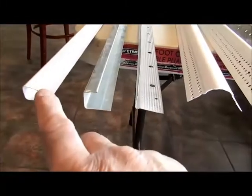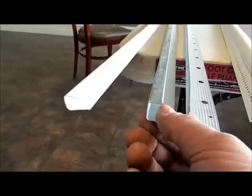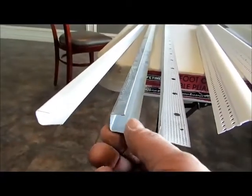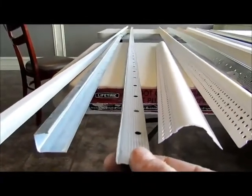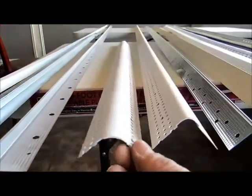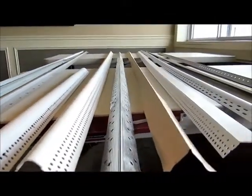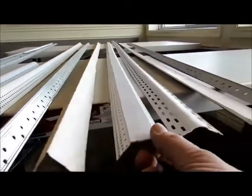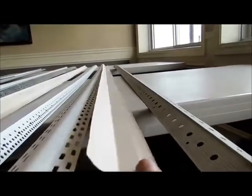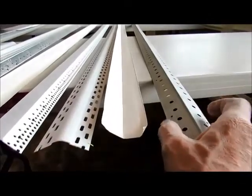A lot of choices here. J-trim — the plastic PVC can be stapled, nailed, or glued. Aluminum and galvanized can usually be nailed or glued with construction adhesive. The metal ones with the holes usually use ring nails. The PVC we apply with spray-on adhesive and staples — usually staples and spray-on adhesive. The metal ones you have to use ring nails or a crimper tool. The paper one, you have to use filler — just filler. And the metal 135-degree uses ring nails; the crimper doesn't work too well on 135-degree angles, it's usually for 90-degree angles.